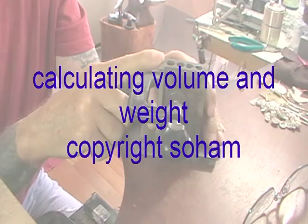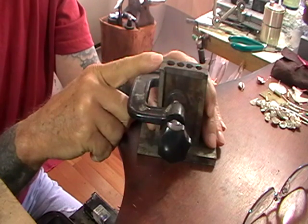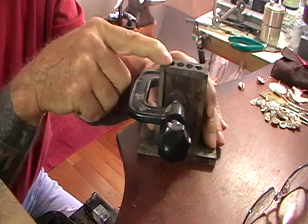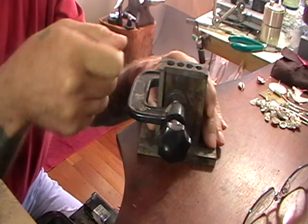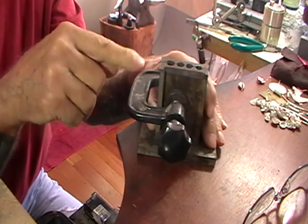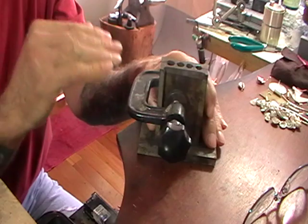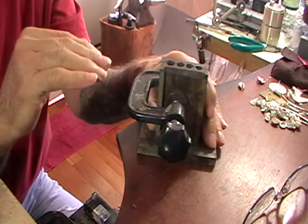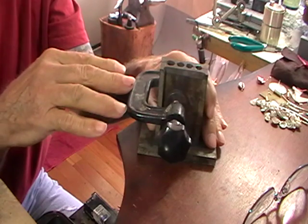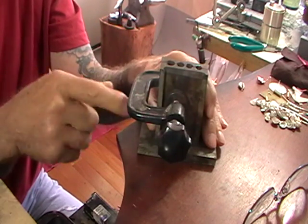If you're going to cast metal into a mold, you need to know exactly how much metal fits, because you can't slowly tip metal in until it's the correct depth. If you do that, you'll have what they call hesitation marks on the metal, and when you go to roll it out, it'll crack at those spots. So when you're casting, you need a nice steady flow.